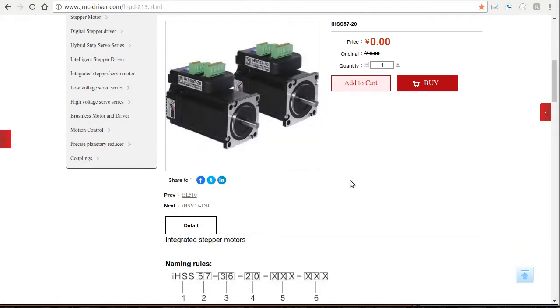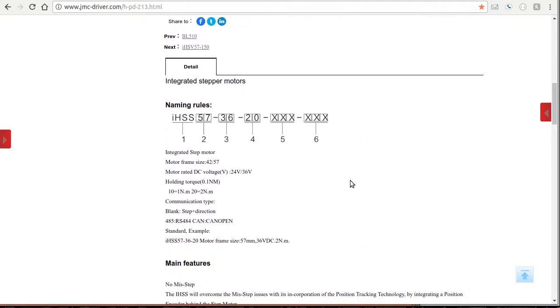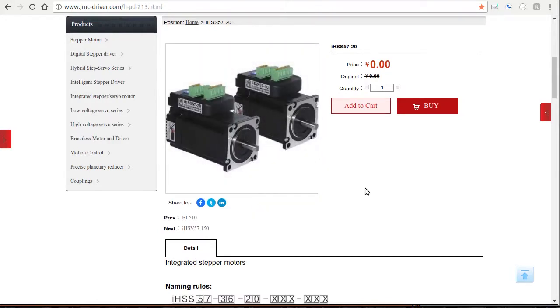Like I said, it's a servo drive, so it actually will hold the step, and it controls all the acceleration parameters and the stepping, and you can run these things. Its encoder is capable of doing up to 50,000 steps per rotation, so it's crazy accurate.